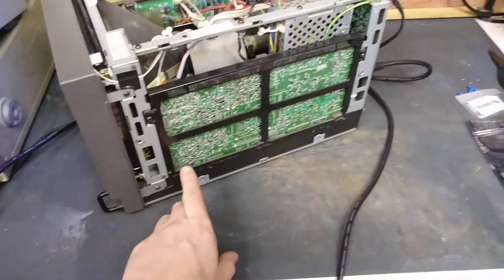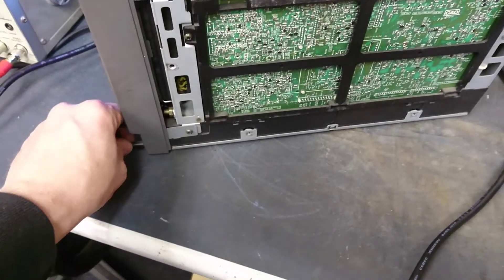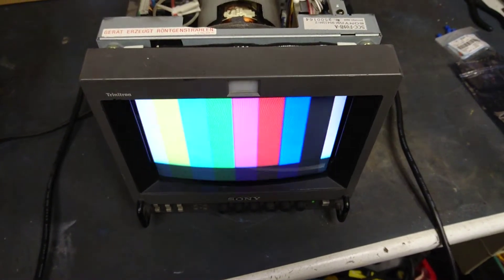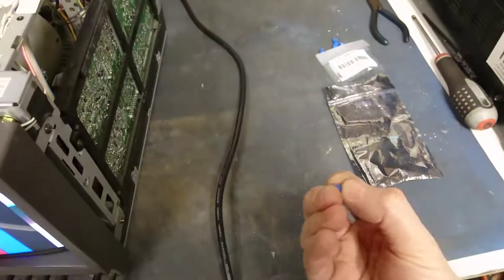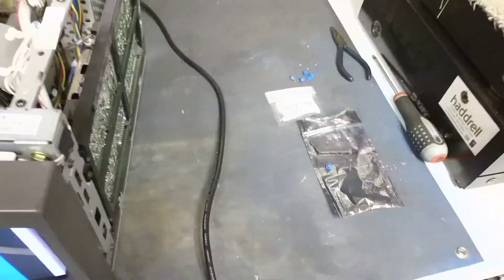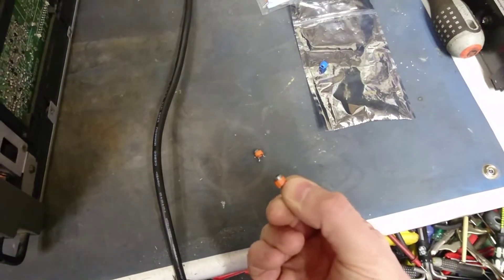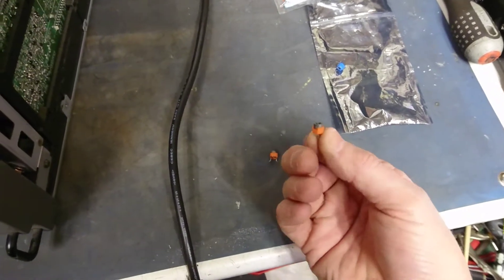It's all back together, screwed the casing back in. The capacitors are located on the right-hand side board from the front, bottom left-hand section in this area here — CV101, CV102. The fault affects most of these monitors that are prior to late 1997. In late 1997, 1998 onwards, Sony reverted to these blue ones, which is why the ones in the packet you'll get if you order that particular part number will be blue. And they are far more reliable than these orange ones. These orange ones are also used in some Sony CRT TVs of the late 80s and early 90s, and they are rubbish.